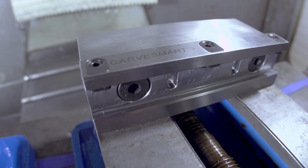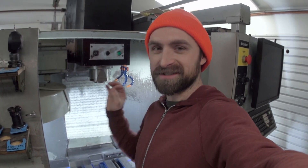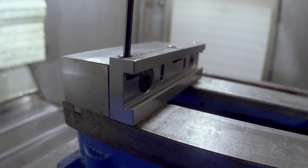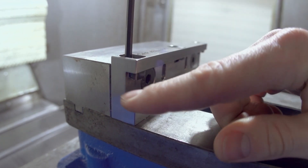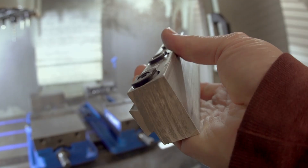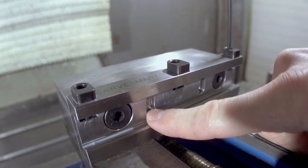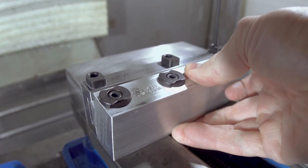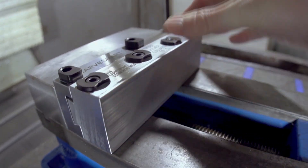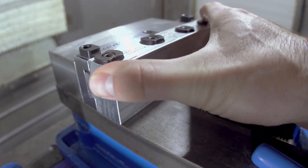So here's what I did. I invested in the Carve Smart vice jaw system — I'm not trying to promote Carve Smart, I paid full price, and they are expensive, but they're pretty sweet. This jaw bolts to the vice the same way the old style ones did, but it has a dovetail cut in. When you loosen these screws, this piece comes up — it also has a dovetail and pops down in there. You can swap it out for another jaw that has a dovetail and a locating pin which interfaces with this little groove right here. Because of that locating pin, it can't move side to side at all. You tighten these down and that jaw is in the exact same spot every single time.